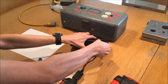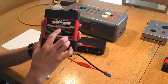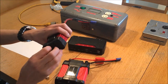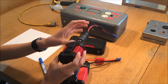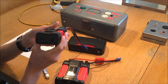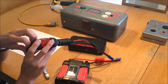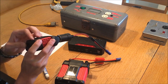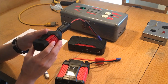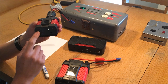The next inverter is the 400 watt model — the upgraded bigger version. It's a 400 watt continuous, 800 watt peak inverter with two plugs and a USB port. A word of caution: I do not recommend using these USB ports with anything of great value. I've taken this inverter apart and there is a small buck converter that directly converts the 12 volts DC in to the 5 volts DC out. If anything goes wrong with it, you could be sending 12 volts into your device, which could be catastrophic.